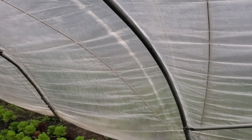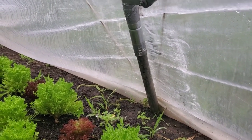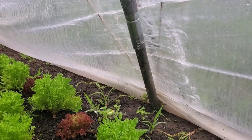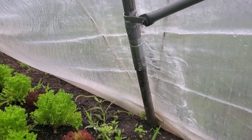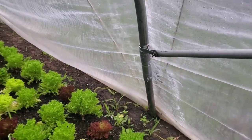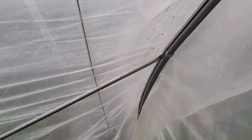For the bows I used a ten-foot piece of top rail — ten and a half, that's what it sells at. I got one bend here and another bend down towards the bottom. I did add 16-inch pieces of pipe extension on the bottom — if you put the swaged end down at the bottom you can cut pieces and slide it on easier. Drove a rebar stake in just like a regular cat tunnel, drop the clip over it, and on the corners I put in some diagonal braces. That really helps keep it from rocking.